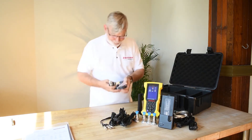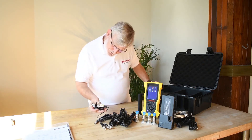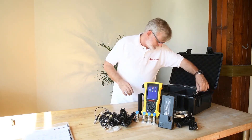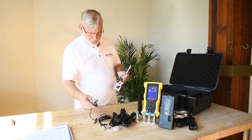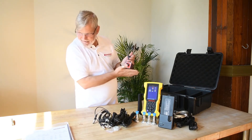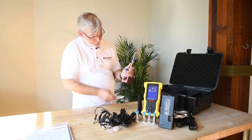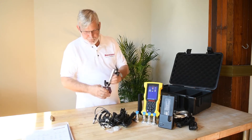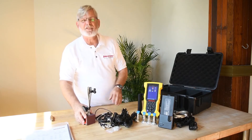This is your tachometer — laser tach. And reflective tape. The holder for the tach has an on-off switch. It drops the magnet down so it can engage, and when you turn it off it reduces the magnetic signal so it comes off the machine easily. You'd put this on and then mount your tach — it just makes life easier.